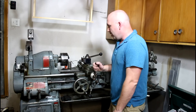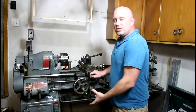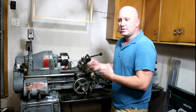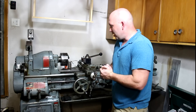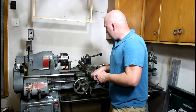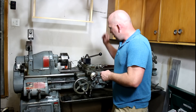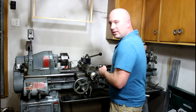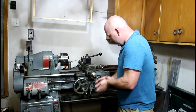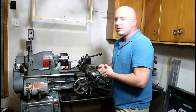This is quite a bit of a step up from the Heavy 10 which I have in my basement. I'm not sure yet whether I'm going to keep both or sell the Heavy 10 and restore this one. I hate to sell this one because it's in such nice shape - it's got the hardened bedways, the large 240 or 250 increment micrometers, a taper attachment, a telescoping steady and follower, a collet attachment, draw bar, and original South Bend three-jaw and four-jaw chucks. It is a three-phase machine.